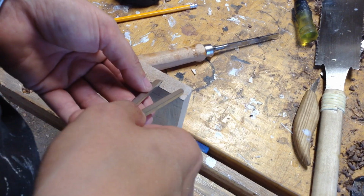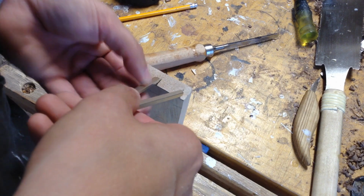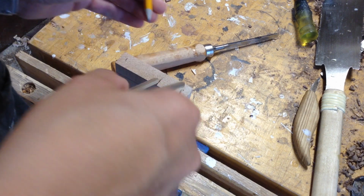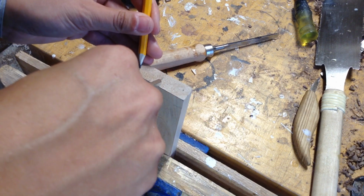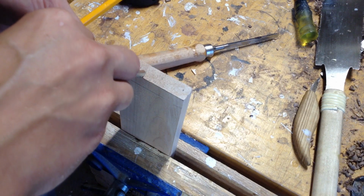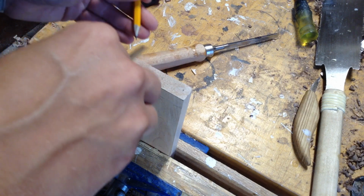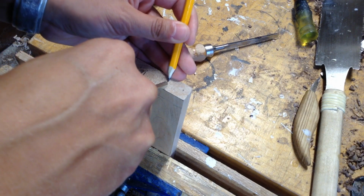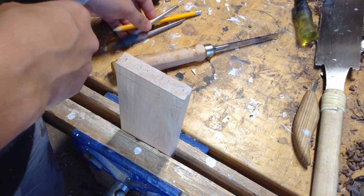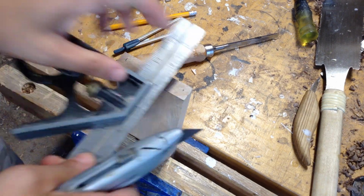And I'm basically making a 1/4 inch mark off the edge, getting it so that 3 of those caliper movements will get me to the other edge, and once it's perfect, I just open it up a little bit and then make marks. You can see it goes past the original mark, so then I center it on that other mark and then make new marks, just flipping the calipers. This is a method I've seen online that a lot of people who make dovetails use, and it just gives you equal spacing on the top of that piece.